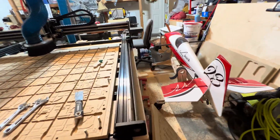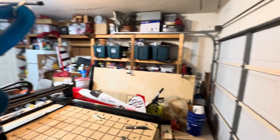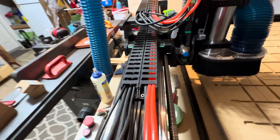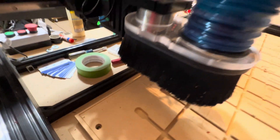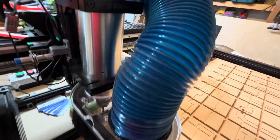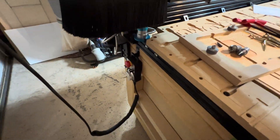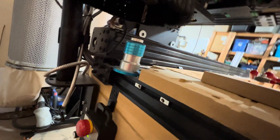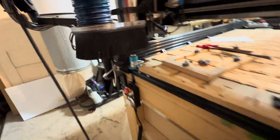While the homing sequence runs — not that you can really see how I mounted everything, but I basically put the cross members down and bolted them with brackets to the top of the tabletop, then mounted the rails on top of those with brackets. Now it's coming up to the top. I'm using an automatic tool setter, so what it's doing at the moment is going down and touching off. There it is — it now knows exactly how long that tool is.